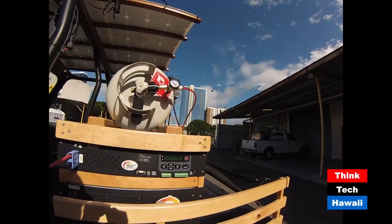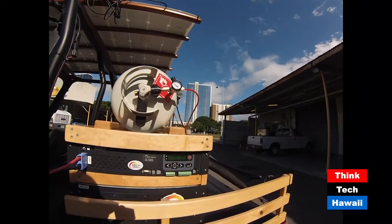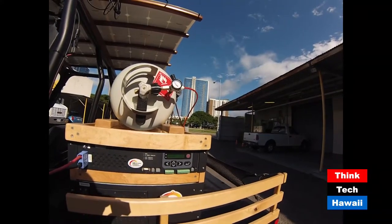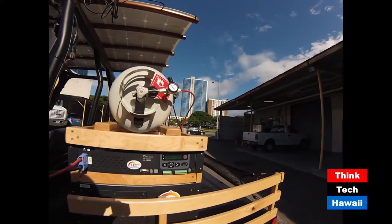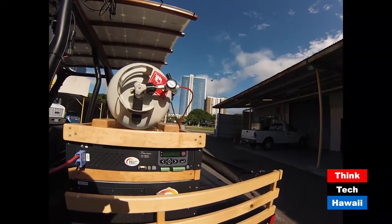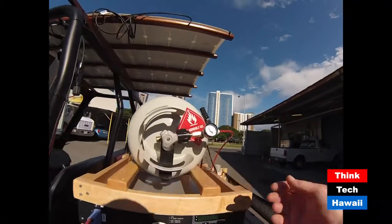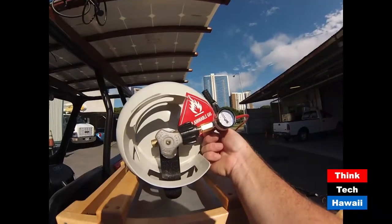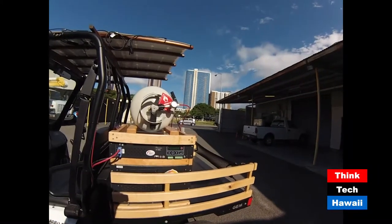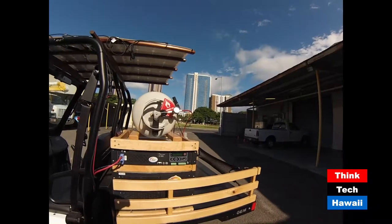The batteries have 50.6 volts on it. It's doing a self-check — it said there's a mid failure. I think it's because I'm letting the pressure drop on the tank with the regulator set so low. But it's charging the batteries at 6.6 amps and I have 50.9 volts. The pressure is dropping to zero, so I might just open it up a little bit and keep the pressure higher. It should be okay now — hanging around 7 amps and 51 volts, charging away.